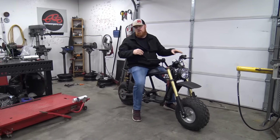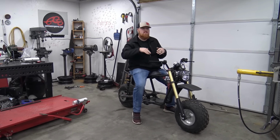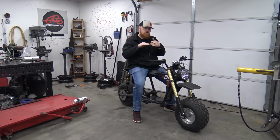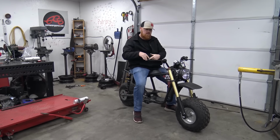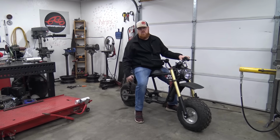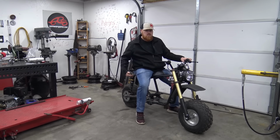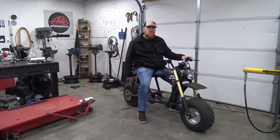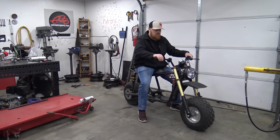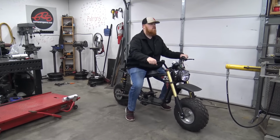And the chain, you know, the pivot point. Why dirt bike chains don't loosen a lot is because the pivot point is so close to the sprocket on the engine. Like the Trailmaster was off like this, and you never kick a chain. It'll loosen a little bit in the suspension travel, but it never gets loose enough to kick the chain. This one's the same way. It barely loosens. We have it fully tightened. We'll have to retighten it once we ride it, but you can barely move it once I jump on it. That's pretty sick.